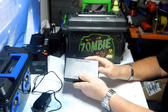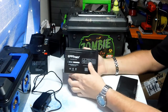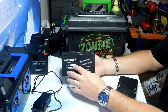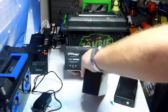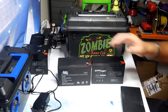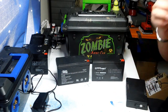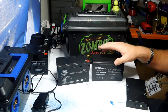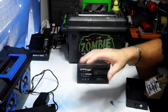Bluetooth and Bluetooth with FM circuit boards work fine on lithium-ion. If you're going to use a larger amplifier or especially a car radio, you're going to need a lead-acid battery. I don't go smaller than a 7 amp hour — I prefer an 8 amp hour myself, which is only about $17 or $18. Also try to get batteries made for constant draw. These here are made for alarm systems; this one's made for an electric wheelchair, designed to be constantly pulled on and charged back up.